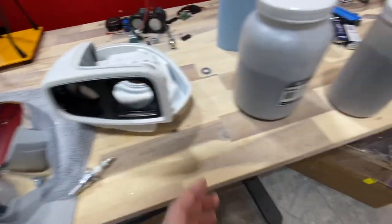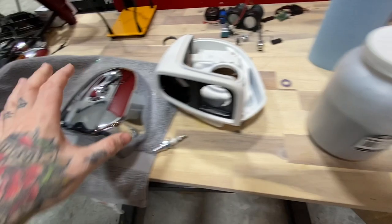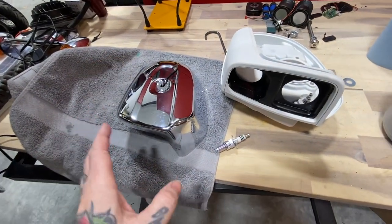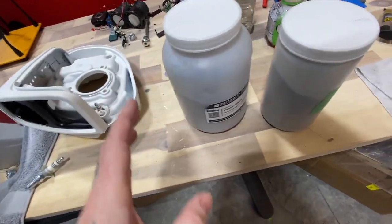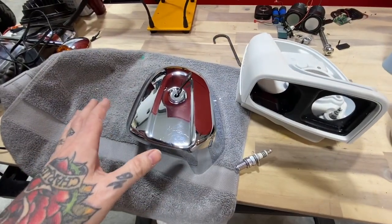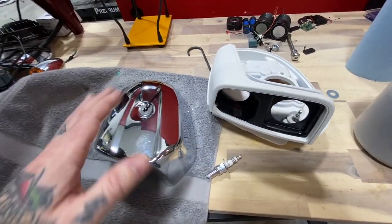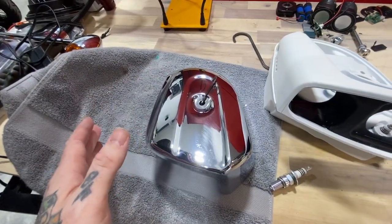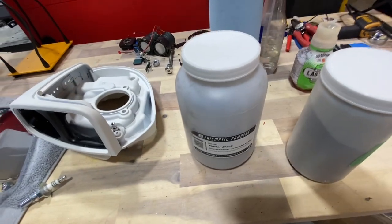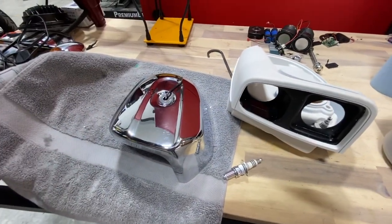That's going to be golden brown on the bottom as the base. Then I'm going to do this really cool vintage effect I've been playing with. I'm going to powder coat it flat black for a second coat, then put it in the oven just so it flows out, and then I'm going to sand it to make it look old, and then put it back in the oven. So I'll show you guys how that's going to turn out. Let's start powder coating.